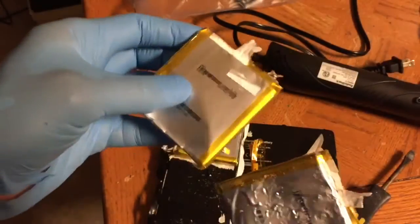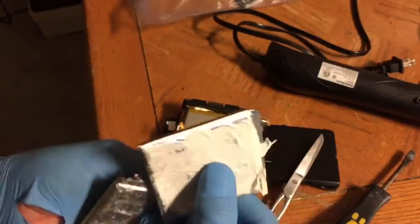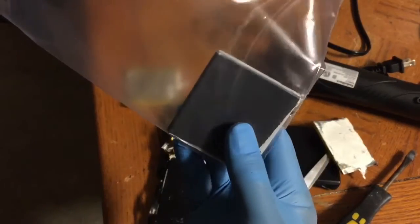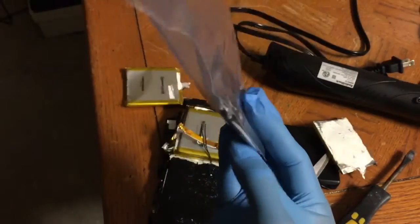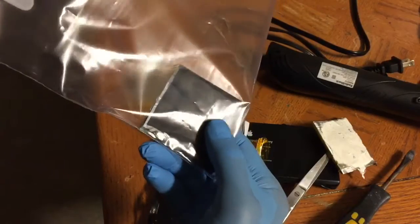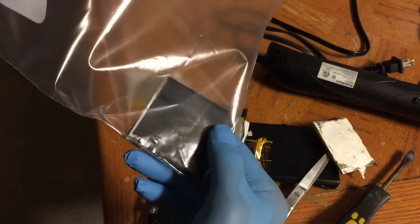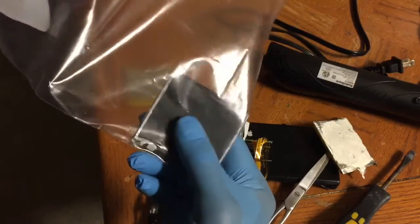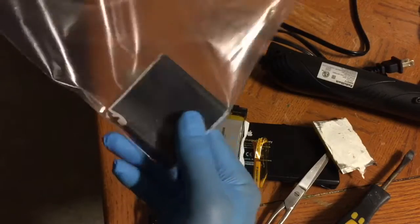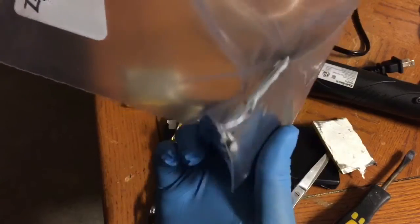There we go — the cases look intact. Here's one that I already opened. I've put it in this bag because it has a lot of argon in it, just in case there's any reaction. There's a lot of solvent soaked into this material. That black layer you can see there is carbon, and if you wash that off there's copper right underneath it. There's a volatile solvent soaked into it, and I believe it polymerizes and depolymerizes the layers within the cell, which have to be tightly opposed.